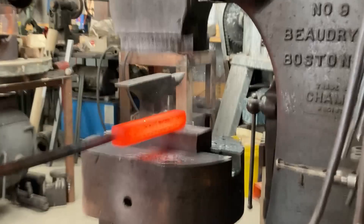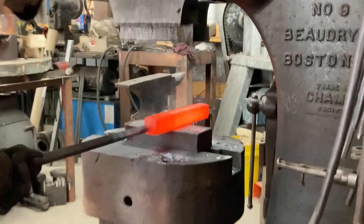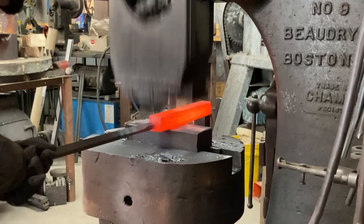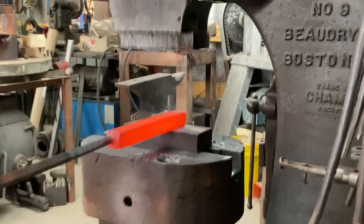I started the tumble-and-forge on the bias with quite a heavy cross-section still, which I was happy about. That's always my preference — do a re-square and still have some cross-sectional thickness left to have options afterwards and preserve billet thickness, especially for the wider knives I like to make. Here I found myself in the enviable position of having a re-squared billet that was still a little heavier than I needed, so I figured, what the heck — let's slap it in the other machine and use the drawing dies to our advantage and see how that does for fun.